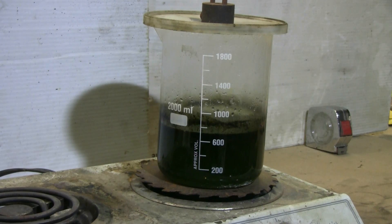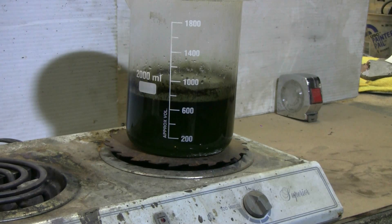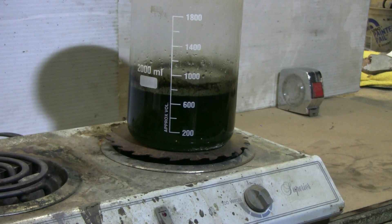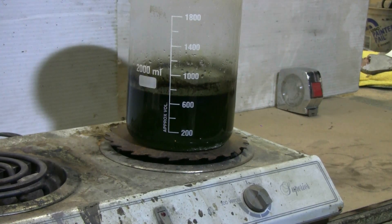What will happen is the hydrochloric acid will slowly break down and dissolve the steel wool pads. What you'll form is a greenish chemical called ferrous chloride — this is our precursor to ferric chloride. The steel wool pads will dissolve one after the other; keep adding them until no more will dissolve. You'll wind up with a green solution, and when you allow it to cool, crystals may even form on the bottom. This is not yet ferric chloride.